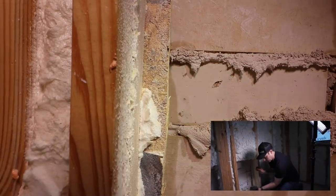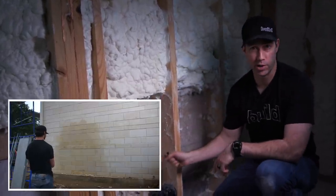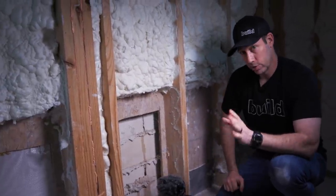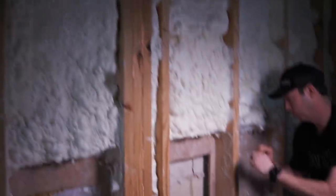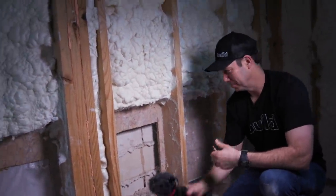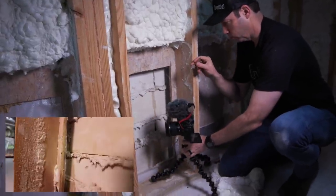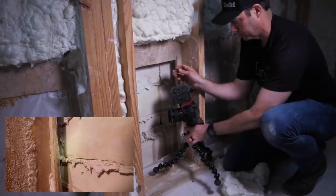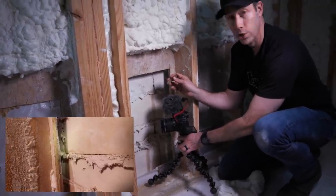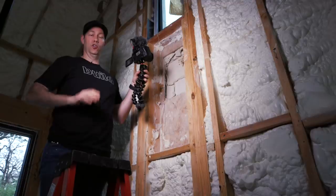All right, I think the test is probably okay to stop now. I think we've proven the point that water does penetrate this stone or brick. What I'm curious to see is how much faster it would penetrate where we've got a window above. We cut an inspection hole right below the window, and we're going to reset here. It is absolutely pouring through that hole right now. I'm so giddy that my test worked just as I thought. We're going to reset the test — look at all that water just absolutely gushing into that cavity. We're going to reset and have Jordan spray that window down up there.